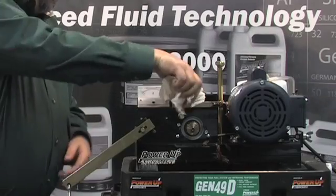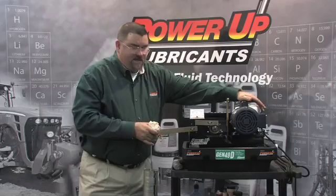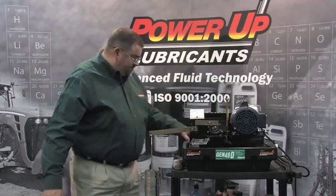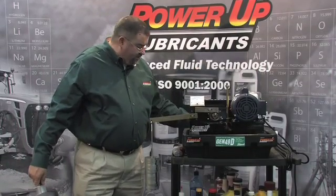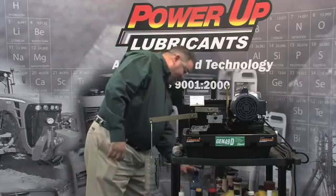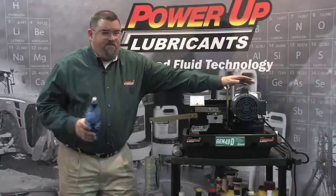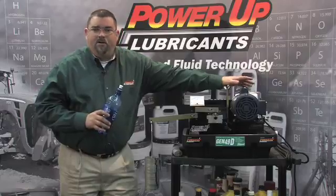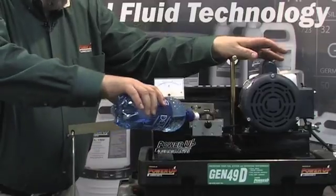Now I'm going to put this back on here, and we're going to demonstrate one other quality of Thixo grease — its resistance to water wash. We're still running at 14 weights, which is double the amount of pressure that we had with the lithium complex grease. We're going to add a cup here and contaminate with some water. Resistance to water wash is very important in the marine industry, and it's also very important in wheel bearings, boat trailers, and things like that. In rainy situations or situations where you're running through water, when that grease comes in contact with water, you don't want that grease to separate or run out of the bearing. So let's add a little water and see what happens.